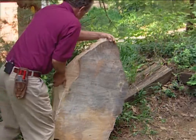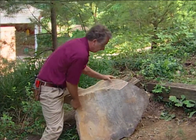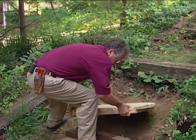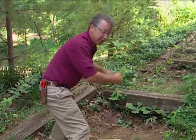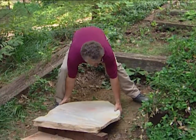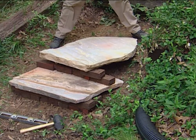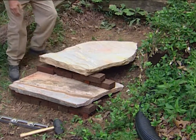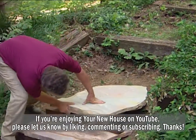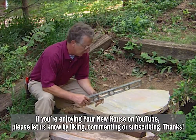It's not a bad plan to have a helper with you when you're working with stones this big. These things are heavy. I'm not concerned at all if these steps go straight up the hill or if they kind of wind their way up the hill — in fact, I think that would be preferable. What's incredibly important is having each step level and each riser identically the same height as the one before it. This rock is heavy enough that gravity alone will keep it in place.